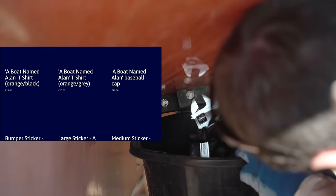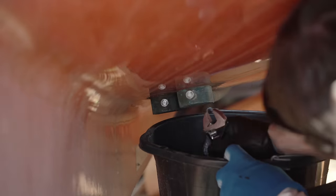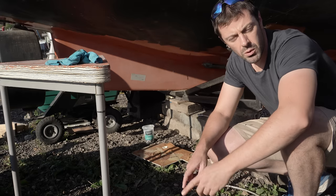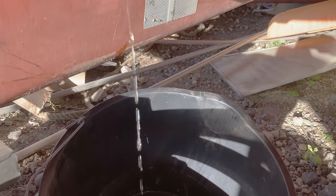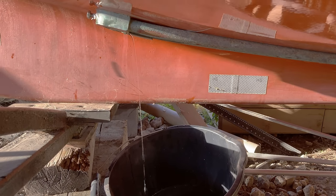We need to gravity drain the cooling system. There are two bolts, and neither are at the absolute lowest point of the coolers, but it's my only option — unless I had Alan lifted and tilted back. I lack the budget for such tomfoolery. The cooling system is not detailed in the engine's handbook, so some of this will be guesswork. I unscrewed the bolts — I wasn't overwhelmed at the resulting torrent. You are now observing what I'm confident will come to be known as the big drip. There's at least a couple of gallons of water in the system, so this may take a while. At least the water and coolant appears pretty clear, and not like the runoff from a mud heap. But with some fiddling upstairs, Alan's stage fright ceased — flow at last. I knew there must be some water trapped in the many twists and turns of the cooling system, but we got half a bucket out.